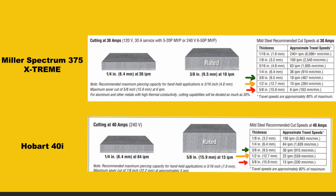The first thing we really want to take a look at — the meat and potatoes of this whole video — are the cut ratings. What are you going to see with a 30 amp machine versus a 40 amp machine, given both machines are the same price? Luckily, in the manuals they provide tables showing the different inch-per-minute ratings at different cut thicknesses with mild steel.